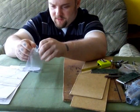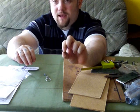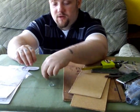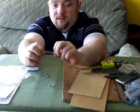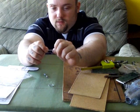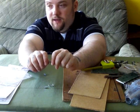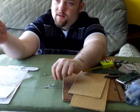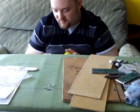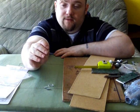You're going to need some kind of small pin — like a 2mm nail about an inch long — that's to hold one of the springs. You're going to need a little bit of wire to hold the spring on. You're going to need at least one tension spring — these are the ones that pull rather than push. Possibly two, as I may change the nut to be self-adjusting and we'd need a spring for that. Then you're going to need a little bolt that's about 12mm long, about 3 or 4mm, with a washer and nut — that's for the front sight.